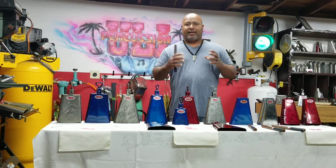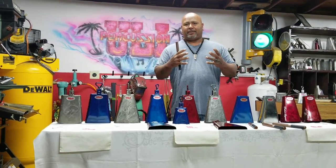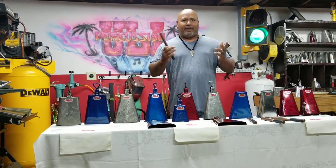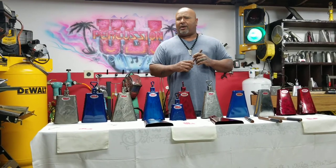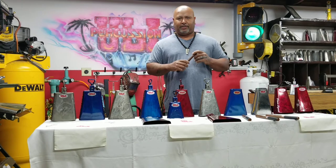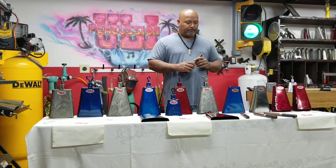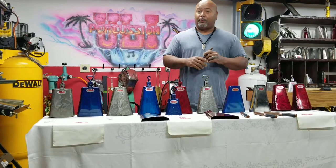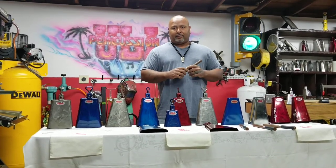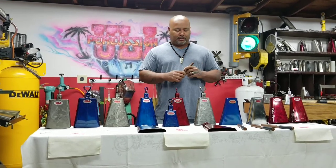You need electricity and the powder goes onto the steel. Then once the powder is on the steel, they put it in the oven and bake it under 410 degrees for 15 to 20 minutes, depending on the piece. So it's very durable — it's not like can spray. It's quality paint, so it's powder coated.